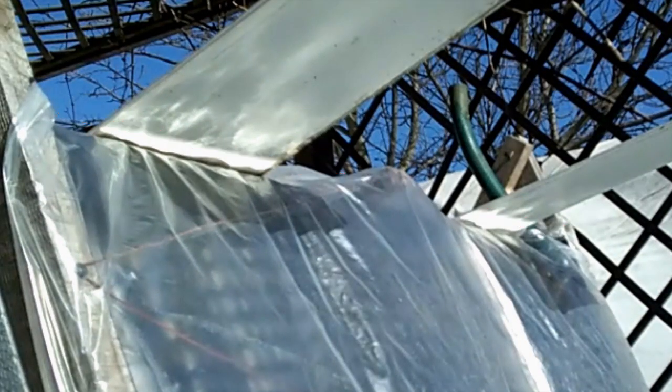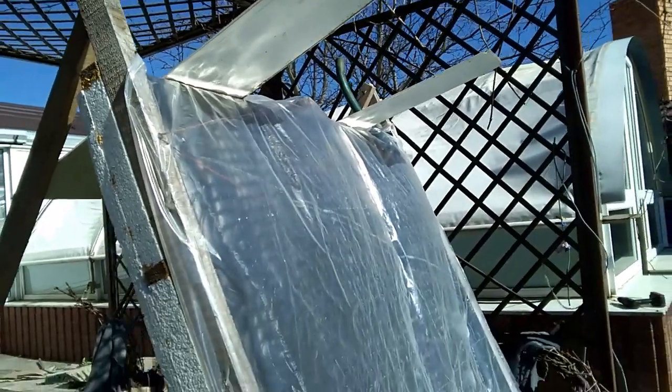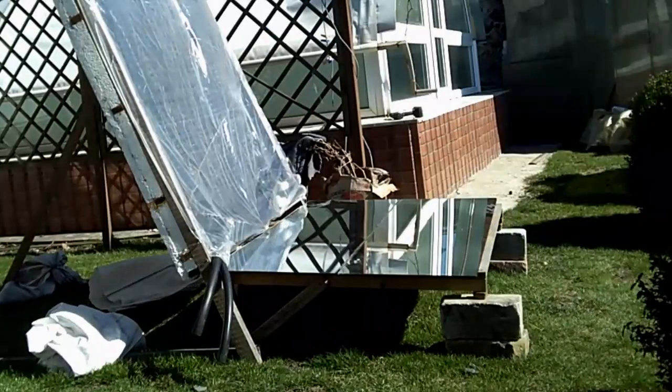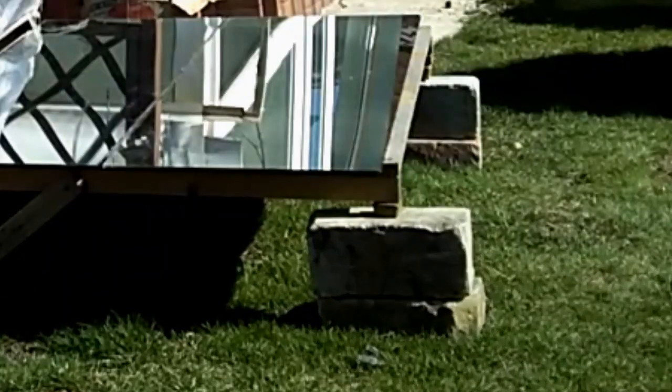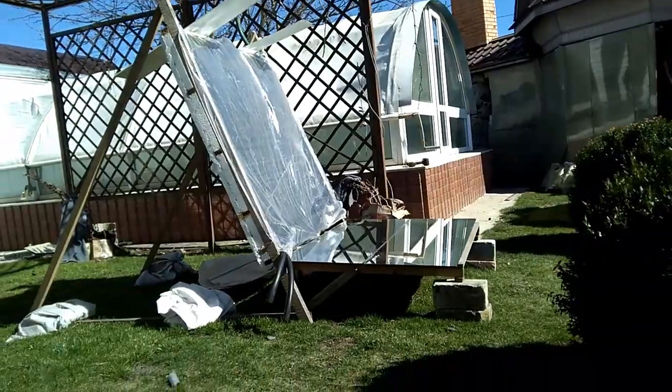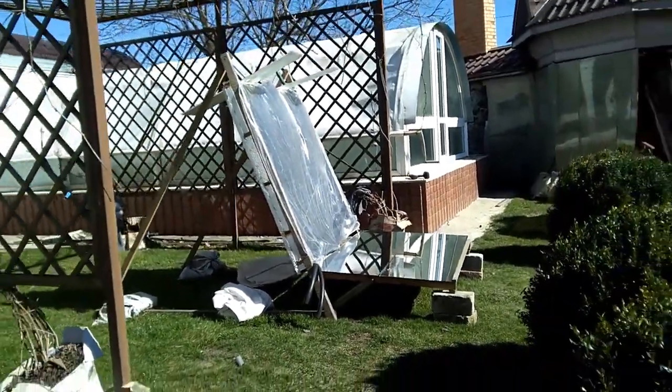Of course, we can refuse such changes in the angle of the mirror, and therefore it will have the same position all months. A fixed mirror will only work well during 3 months — November, December, and January — and it will noticeably reduce the heat deficit of our solar collectors during these 3 months. But our collectors usually no longer have the heat deficit in March, when the help of the fixed mirror is small.